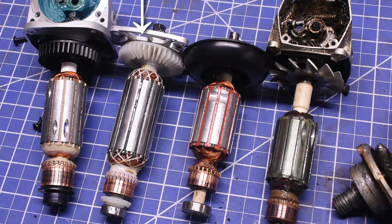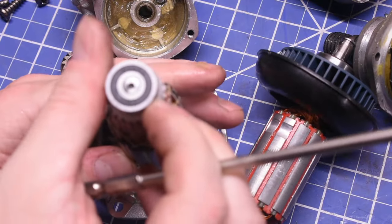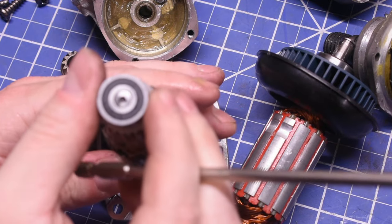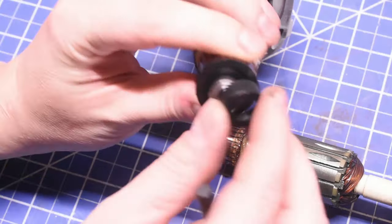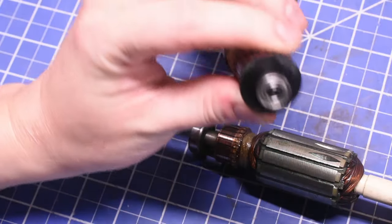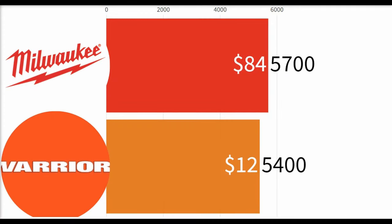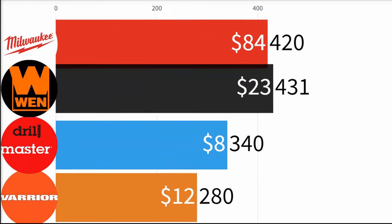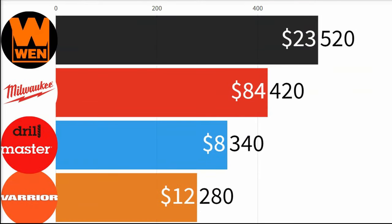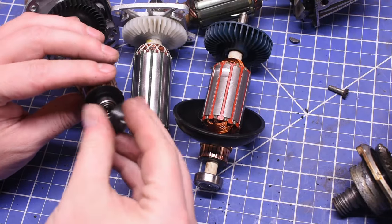In a tool like this with that much air intake, these get caked up and filled with grinding dust eventually. The switches are all pretty comparable, but the last difference is that the Wen uses a sealed bearing at the base of the armature, the Harbor Freight models use a metal shielded bearing, and the Milwaukee uses a tiny metal shielded bearing with a rubber boot over it. Between these grinders — three cheap, one sort of not cheap — it's the Drill Master in front for material removal speed under light grinding, and the Wen for sheer power and build quality, by a smidge over the Milwaukee.